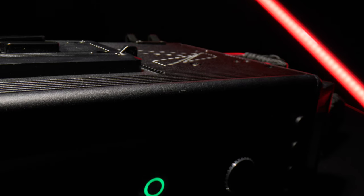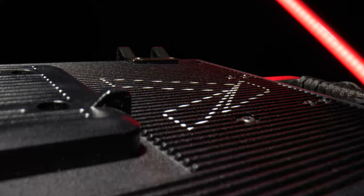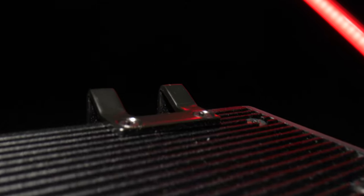On either side of the ballast you've got battery connections for 14.4 volt, 26 volt, and 28.8 volt in either gold mount or V mount, whichever one you pick when you buy it. Another exciting feature is that this power ballast can also be used to charge your batteries when it's plugged into AC power. Any batteries that use a universal charging method can be charged by the 600D Pro. Unfortunately, batteries with proprietary charging methods like IDX can't be charged by the 600D Pro's power ballast — but it's better than nothing. It's also worth pointing out that batteries won't charge if you're running the light beyond a certain threshold, somewhere around 70% depending on what dimming curve you have.